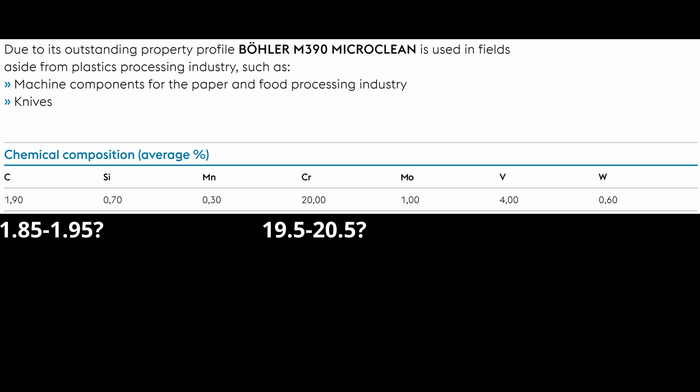The range they shoot for is based on their capabilities. If they're having to throw away 10, 20, or 30% of their steel, they're going to widen the range so they're not throwing so much away. In some cases, they might set a range tighter than they might want, because they know the steel won't meet certain properties if they don't — like if they're under a certain carbon percentage, the steel isn't going to harden correctly. So when he talks about having a more controlled and higher carbon content, that presumably means Böhler is going to guarantee them a tighter carbon range than their normal internal range for M390. Does that mean they're just going to be on the upper end of the M390 range, or are they going to bump up the range a little bit? That hasn't really been clarified by Microtech.